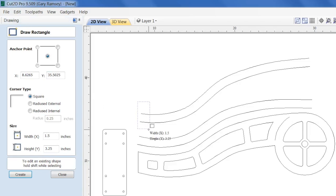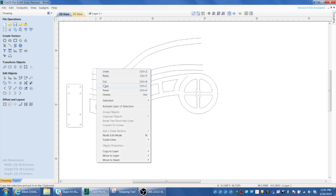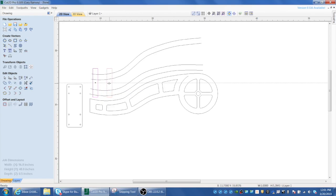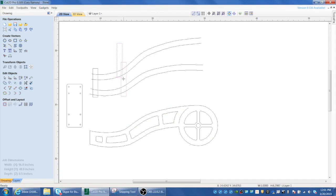So now to create the vertical framing that's also 1 inch, I'm just going to make a rectangle here. And again, we're going to specify 1 inch wide for that rectangle. So just going to place the rectangle. I'm going to make sure it's exactly 90 degrees because that's going to mount to the wall. And we're going to create more versions of this to create those openings or windows. I'm just scaling this one over. I'm going to move this out of the way. I started this a little bit too close to it, so we're just going to drag it down so we have a little more working room and don't interfere with the one we've already got. Again, we're just going to drag this in place, and on this one I'm going to rotate it to make it perpendicular as close as I can to the shape so that it maintains the squareness